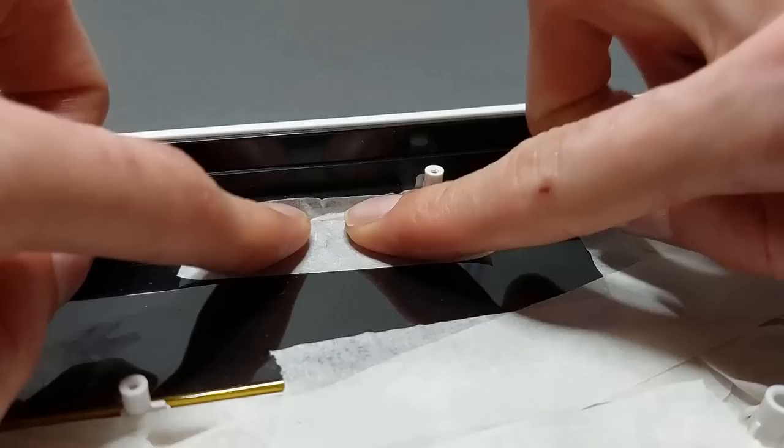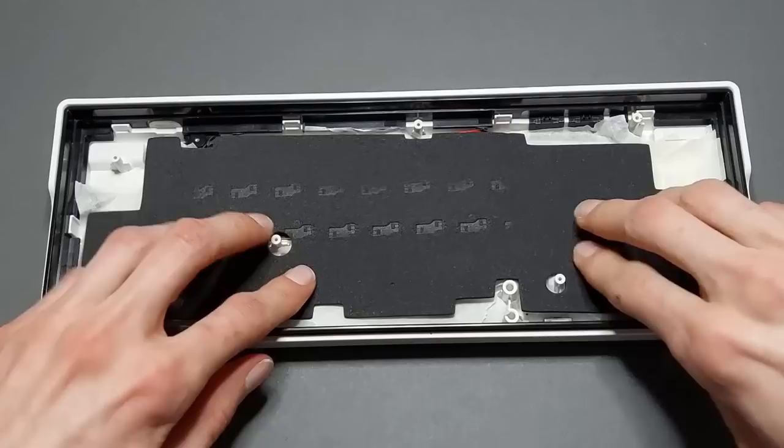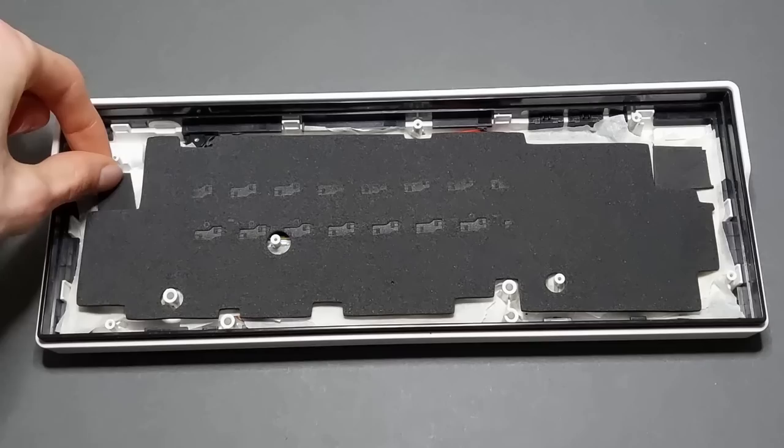After the layer of tape, I'm putting back in the foam that came with the board and a couple of extra pieces just to remove all hollowness and to make sure there is no way the PCB can get zapped by the coins. For the PCB, I'm going to be doing the Tempest or tape mod to hopefully make the sound a bit more poppy.